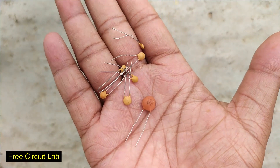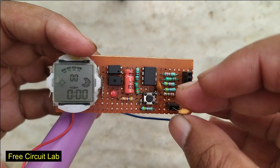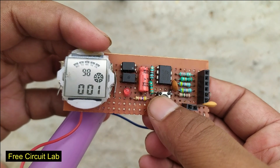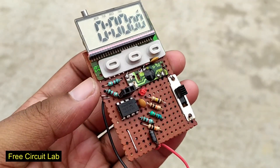Can we measure this tiny capacitor with this device? No, because these are so tiny that the capacitor charges pretty quickly. It does not let us release the button before the charging process ends, and we get a wrong value. So I had to find another trick, and I found it — I made version 2.0.